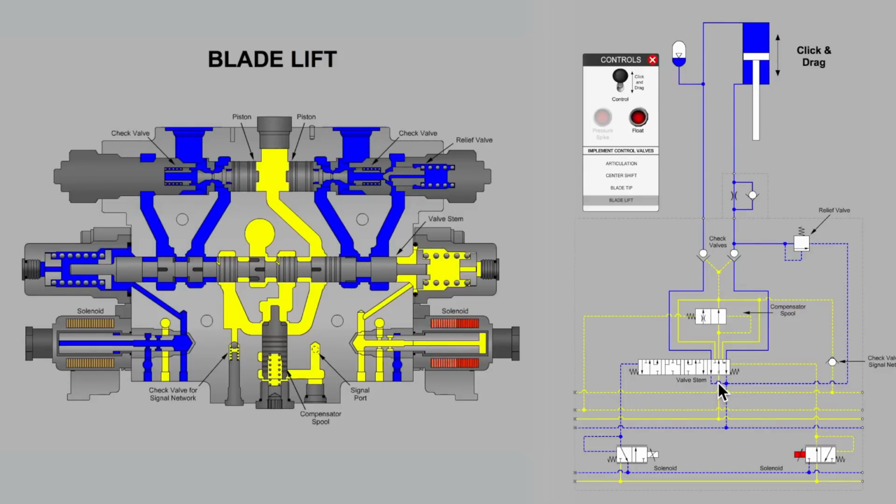And in fact, what has changed here is that we now have a special section of the spool whose only job is to take pressure from the pump. And no, not really flow, right? We're not really pushing any flow through. We're just taking the pressure signal provided and pushing it through to lift both check valve balls off the seat. And since we have to lift both simultaneously, we now have a split piston, two separate pistons. So we have a few more components involved in this section.